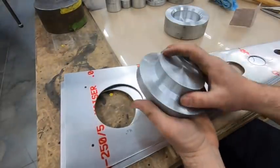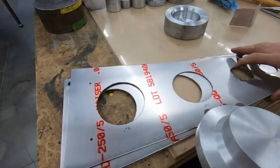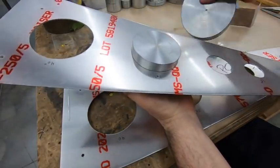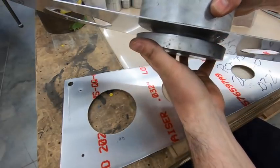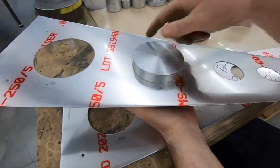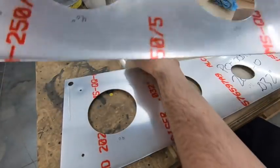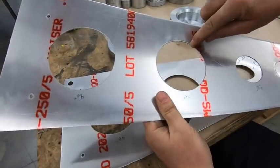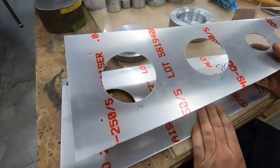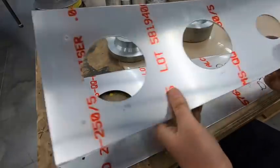These are the dies for flaring the lightning holes. Basically what happens is you put the part over like that and it sandwiches between the male and female dies, and it'll flare that flange. But to flare it, it's going to stretch the material — if you've got an irregularity, a stress riser, or any little nick or burr, there's a good chance it'll propagate a crack and you'll scrap the part and all the work gone into it. So it's well worth the effort to put an extra five minutes in and verify everything's good.